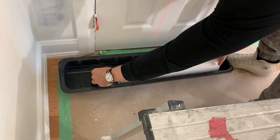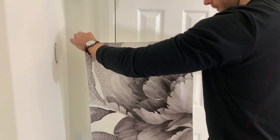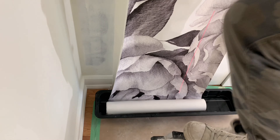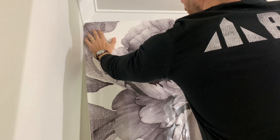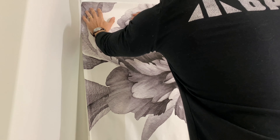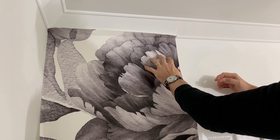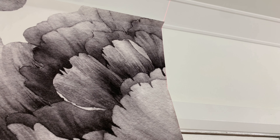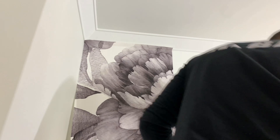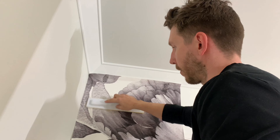So the paper goes in and we're going to count to 15. Pull it up nice and slow to make sure every piece of paper comes in contact with the water. Think about giving yourself enough coverage on the top and bottom. Most wallpaper doesn't come pre-cut — we know this mural fits the wall with about an inch on the top and bottom, so we know how much overhang to expect over the crown and baseboard. Get a rough placement, then check the level line. When snug into the corner, the line wants to move about an eighth of an inch to the right, so adjust accordingly.